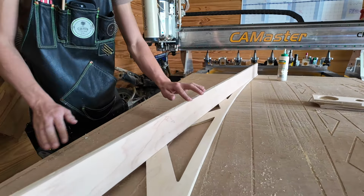Now, after gluing on both sides, Cameron and I are preparing for a well-coordinated, amazing display of synchronization working together. We start at the top, and I mark the location, and with the trusty pin nailer, I lock that piece in as Cameron holds it about where it goes. And then I slightly bend the half-inch plywood as we go down. Then Cameron grabs the pin nailer. It's like we've done this 100 times before. Goes together perfectly. Such a beautiful structure.